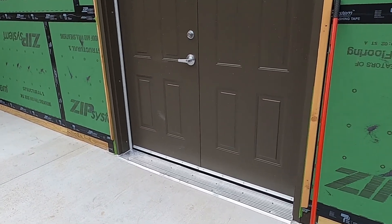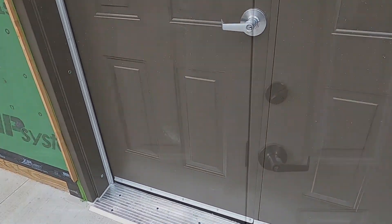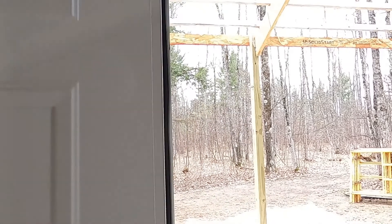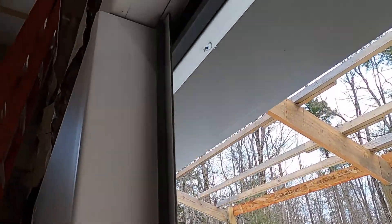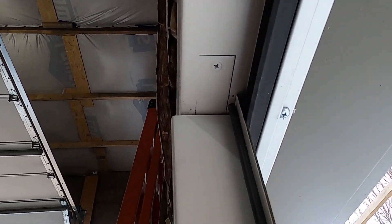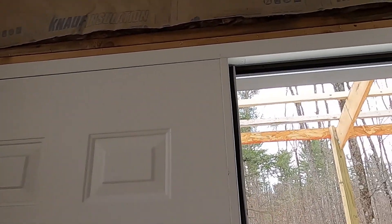The double door has the same type of hardware as the single door, but there's one issue I don't love — it has a fair bit of slop and I can easily see a good gust of wind banging it around. The reason is that this hole up here is really big and there's a fair bit of slop in the connection. That's an area that could benefit from much smaller tolerances. Again, this is an issue where the tolerance of a commercial door is really loose, and we're looking for tight, so it involves a lot of extra work to get it there.